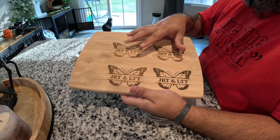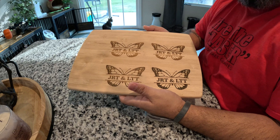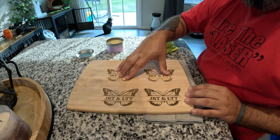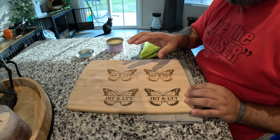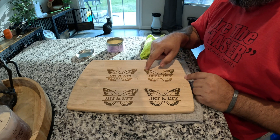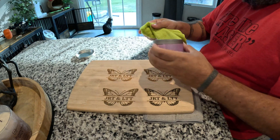We're going to seal this with a little tung oil — you can get it on our website, link in the description below. I'm going to apply it to the top two samples so you can see what happens when you protect the work. It's important to always protect wood work because when you burn with a laser you are opening fibers. Even if the whole board was already sealed, the engraved area is no longer sealed. So it's important to add something to protect it.